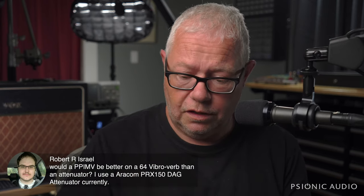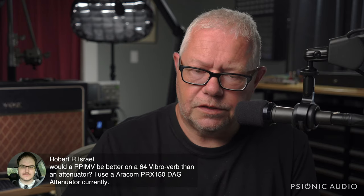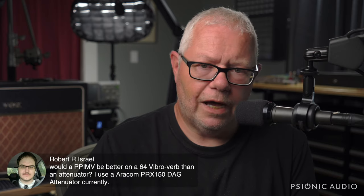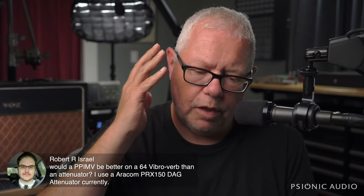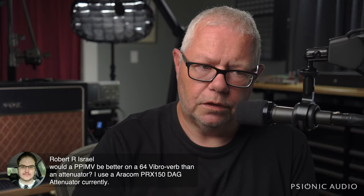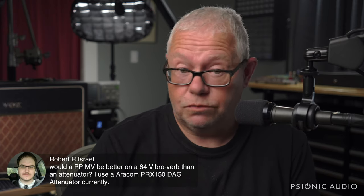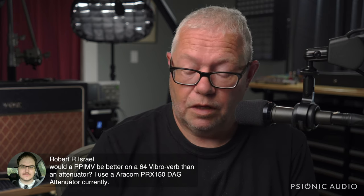And this is something I try to get across to people when people talk about, is it transparent? Our ears preclude transparency. We hear within a certain frequency range much better than anything else. It's called the Fletcher-Munson curve. So if something's up loud, we hear everything. As you turn it down, we are much more sensitive to the frequencies within the band used by human speech than the really high stuff and the really low stuff. So as you turn it down, you begin to lose lows, you begin to lose highs, you still hear the mids, because that's what we need to hear as a species. Our brains are just wired that way. And that's why as you turn things down, it sounds less exciting, or it can sound mid-y.